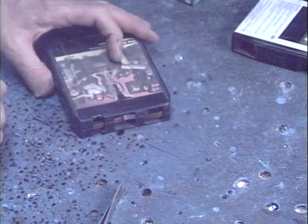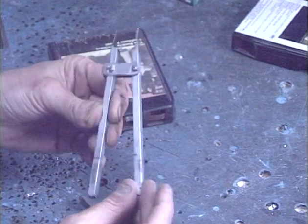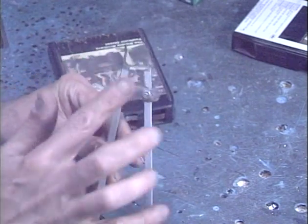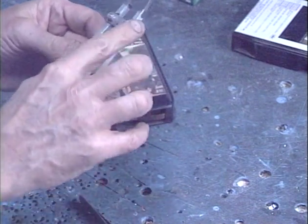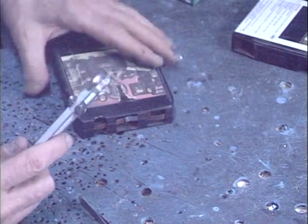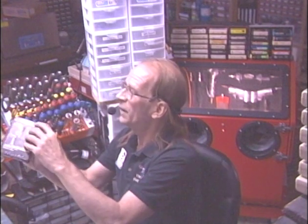Let's go ahead and crack open this tape. I've got this cool little cartridge opening tool that I made — I can make you one for $30 plus about $5 shipping. They're easy enough to make yourself; it's basically a quarter-inch bar stock with a little cross piece. I'm not a collector, so I'm not concerned that the 8-track tapes remain in entirely original condition. If a tab breaks off or I take a little chip out of this area with my cartridge opening tool, I'm not worried about that. My only concern is that the tape plays properly and serves as a suitable test tape.